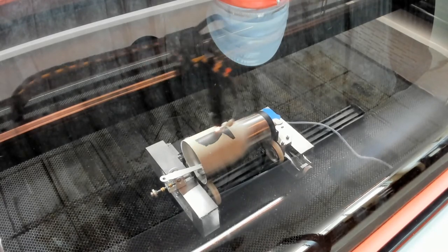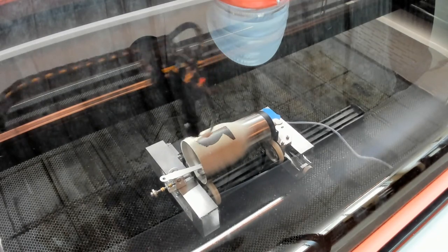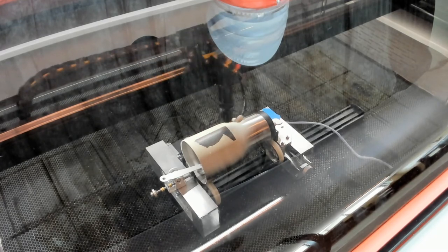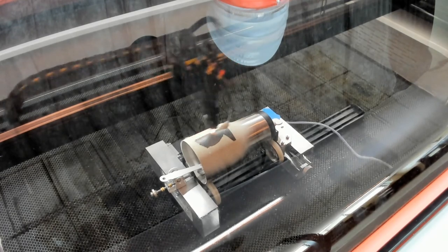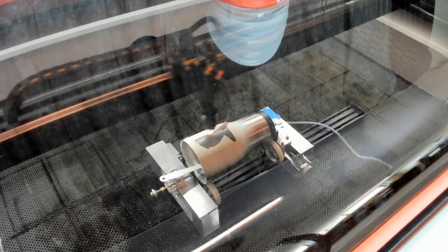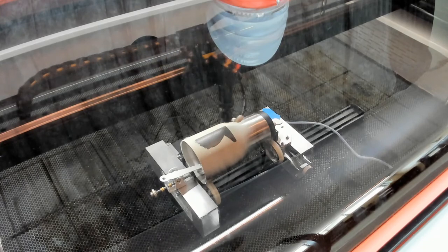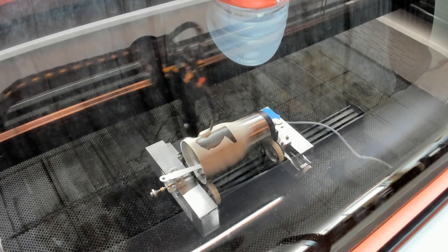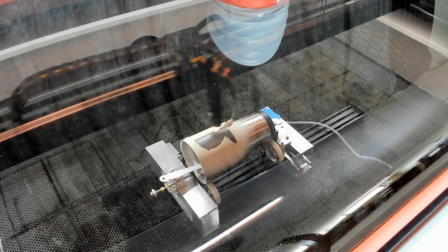Frank's asking a question, probably need 100% power. Yeah, because I think you do have the 2616, if I'm correct. That is a little bit lower wattage of a machine, so you are going to want that in. Now, if we look inside here, I do want to point this out. This looks like a gigantic shadow. Once we wipe the CerMark off, we're going to actually have our image. This is a very typical look when you're working with CerMark.